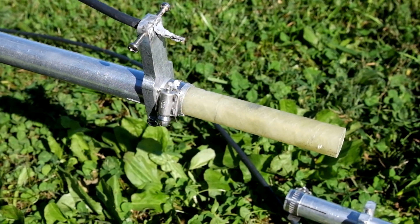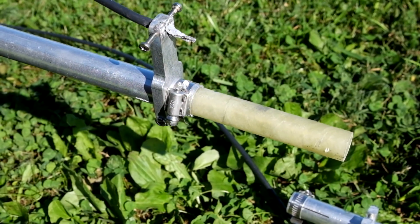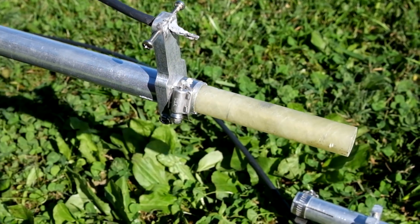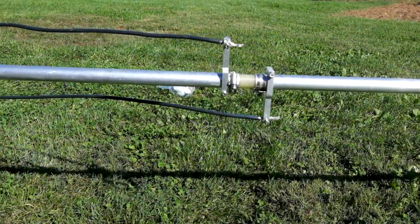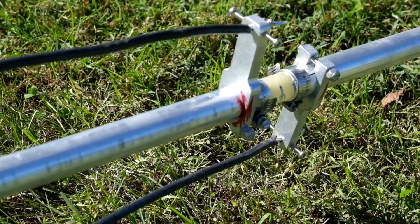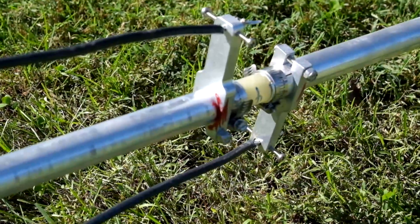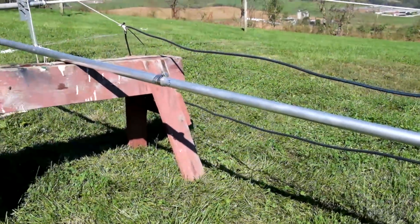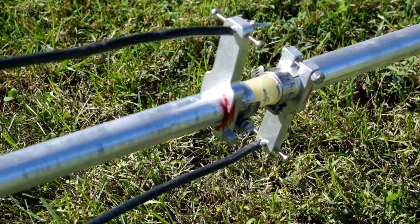The other wonderful piece to make this work are the 7/8 inch outside diameter insulators which MFJ sells under the Cushcraft name. They're just perfect for combining two 1 inch outside diameter aluminum tubes together. Finally, these offsets made by M Squared make this antenna possible. Made out of solid aluminum they are really strong and they have the holes already in place for their tubing. However, rather than using their tubing I used simple number six aluminum woven wire instead. I just needed to run a drill through the hole to make it a tad bigger to allow the wire to go through, and then those screws would tighten down on the wire to make it firm.